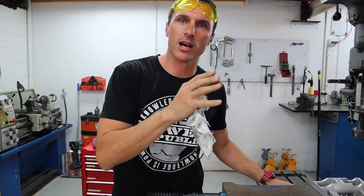This machine is a little bit antiquated and the X axis reader actually reads double. That's why it's saying 204, this is actually 102 millimeters. So that is the hole spacing for Rotax and Vortex. And then we're going to go in the X-axis to 230 millimeters for the IAME,